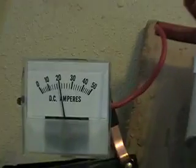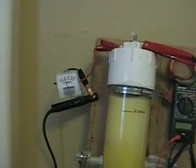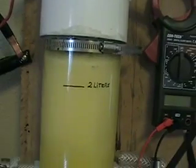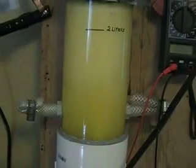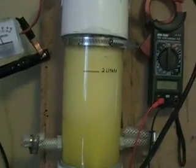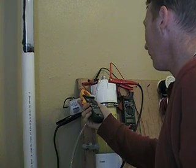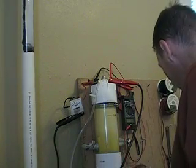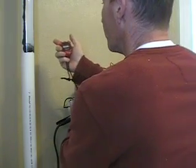We definitely have more gas now — that's about normal. We're looking at about 8 to 9 teaspoons for two liters of distilled water. Let's hook up some leads and do a displacement test at 19.4 amps, 11.57 volts, and see what we get.